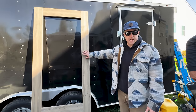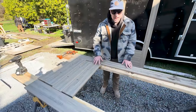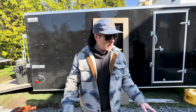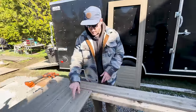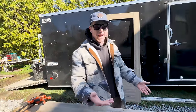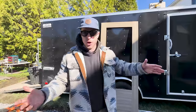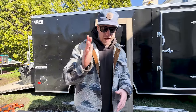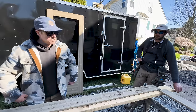So we've got one side of this built. We're gonna show you how he's gonna put this together. And the biggest thing that we figured with the assembly of this was pocket screws. It was really the only way that we could get this all assembled with hidden fasteners. You see, we've got all of these pocket holes. So we decided it had to be a 2-ply door. We've built 2 of them for each opening, and then we sandwich them together, and there'll be a couple exposed screws like we have on the other one. We'll show you how we do that, but it turned out great, and show you how to assemble it.